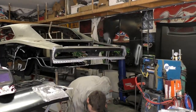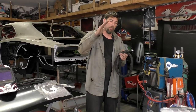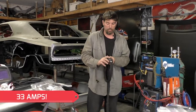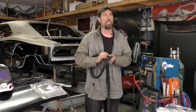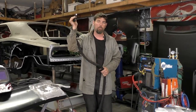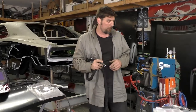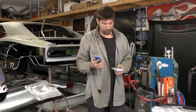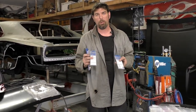If we're three-quarters of the way down on the foot pedal we might be three-quarters of 45 amps — it's all relative. I do have a trigger switch; we're not going to use it, but if I was in a tight area or welding upside down where I couldn't get my foot in there, the trigger switch gives us on and off at full amperage. For tungsten, we're going to be using different tungstens. I know thoriated and lanthanated tungsten are options — there are so many tungstens out there you could do a whole separate video on it. Thoriated or lanthanated is probably your best tungsten to start out with.